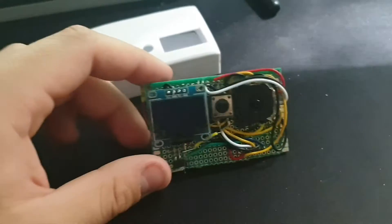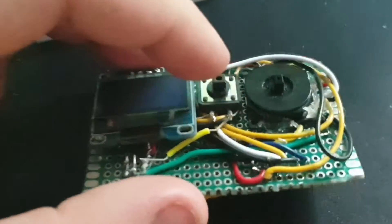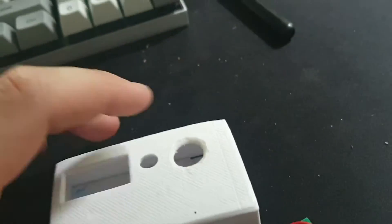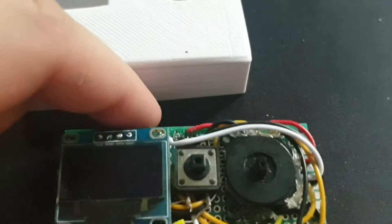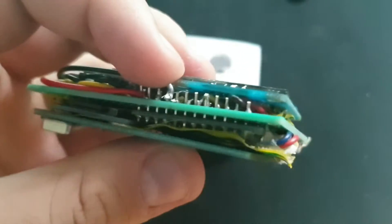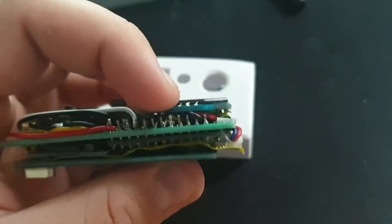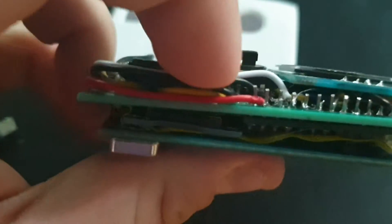All of these parts are cheap parts from China so they're not the highest quality but they work fine. The OLED screen is about 0.96 inches — basically one inch, single color. There's a big push button and a PSP joystick which is pretty low profile. I've lost the cap for it but it works without the cap. Inside there is an Arduino Pro Micro with the ATmega32U4 processor, which gives it HID capabilities.